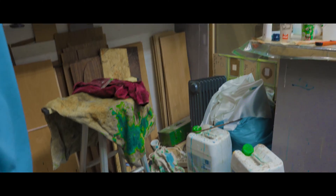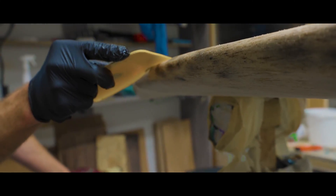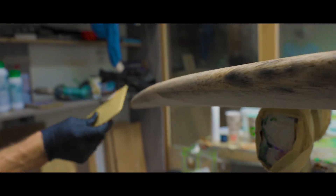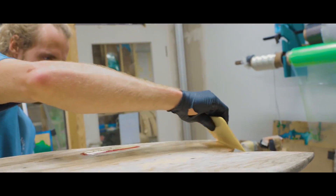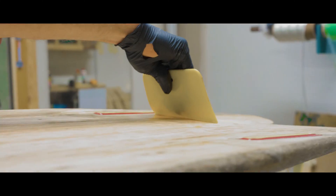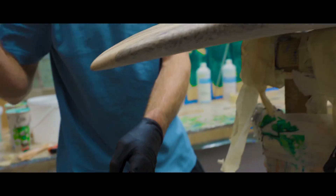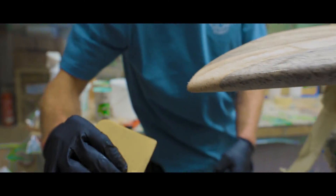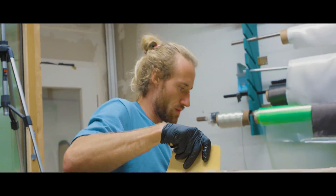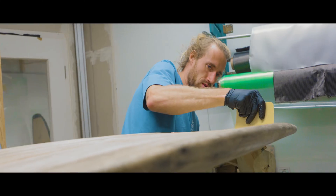Get fast on the rails because we don't want dripping. We can collect the epoxy with the squeegee pretty well - no dripping epoxy, nothing to sand. Here the same: remove external epoxy like that, same to the back here.